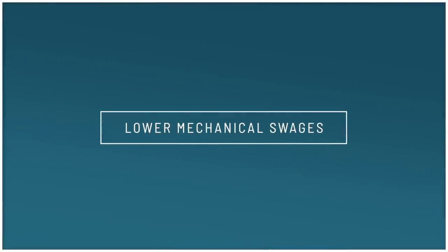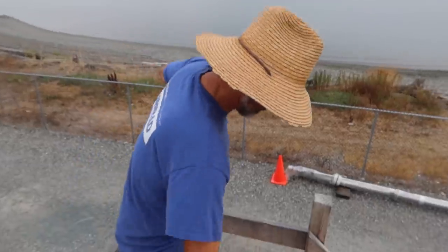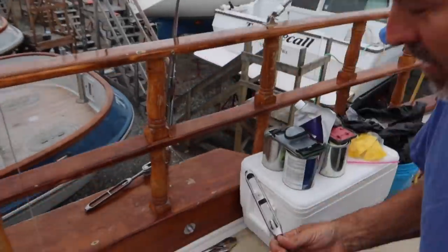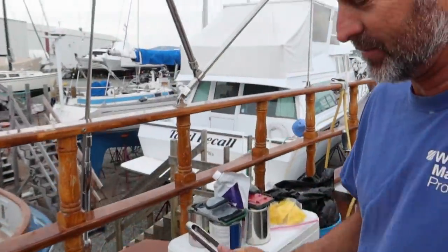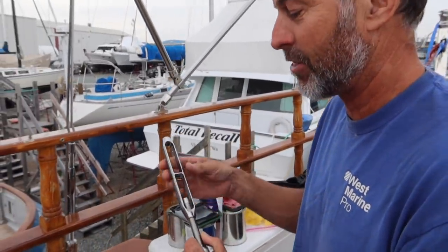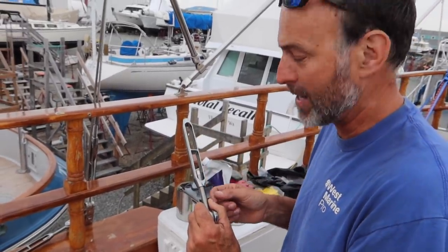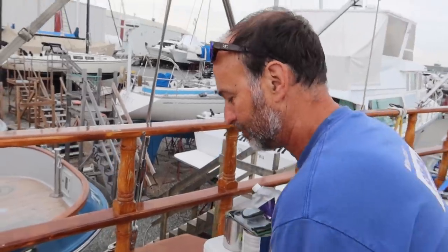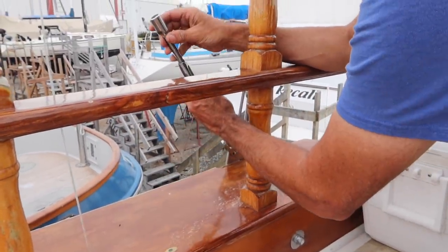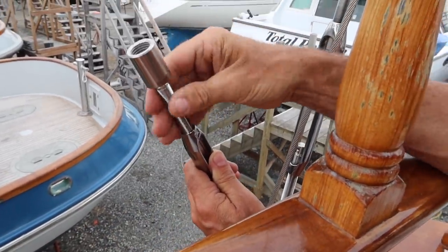This is like how to do it — are you looking up how to do it? I've got to Google this one. I called my mom and checked the inner Google and they both said the same thing: read the instructions on the package. Here's the instructions — for those of you who can't read, the good news is it's all visual. I'd like to have your turnbuckle set to a third — only a third, not a half — because it will only stretch and grow over time and you don't want it to bottom out. I'm going to spool my Staloc mechanical fitting. There's a bunch of brands on the market but this boat came with Staloc because it's a Selden mast, and that's just what they come with.